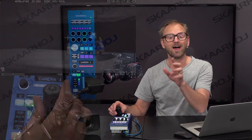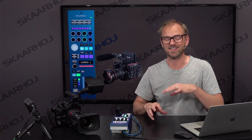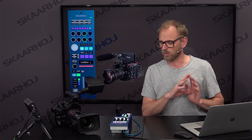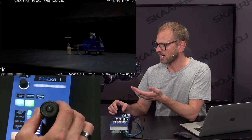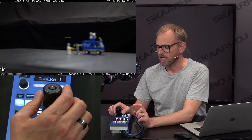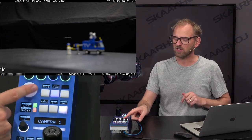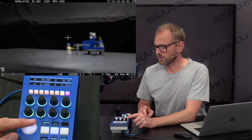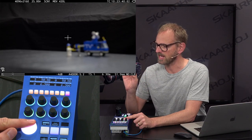That's really great. I also talked about controlling zoom and focus on the lens, so I'll dive right into that. After that I'll get to all the other parameters, which you might have seen in a quick tour through the RCP in a previous video. We can adjust the iris and we can also adjust the master black with the ring here. Now the joystick pad on the RCP — which is this component — is actually pressure sensitive. So when I push the upper side of this component, you can see it's beginning to creep zoom with the lens.